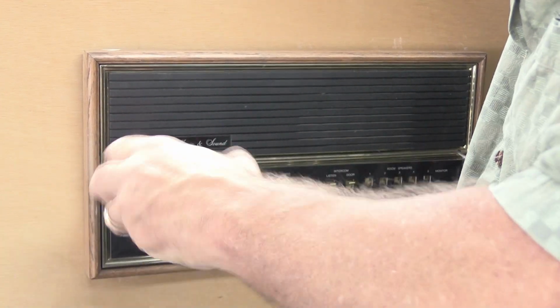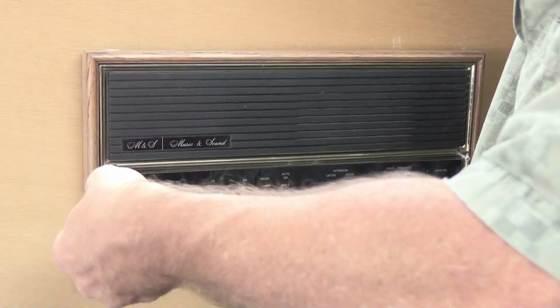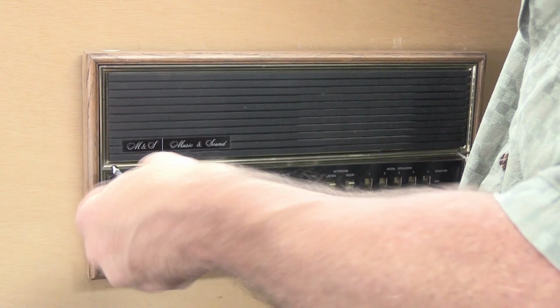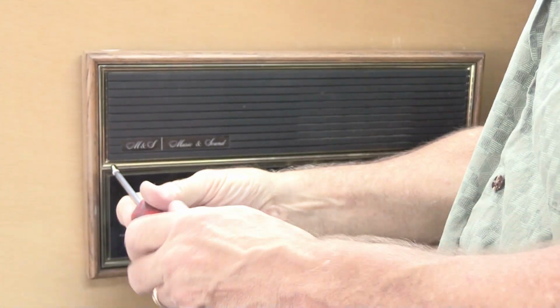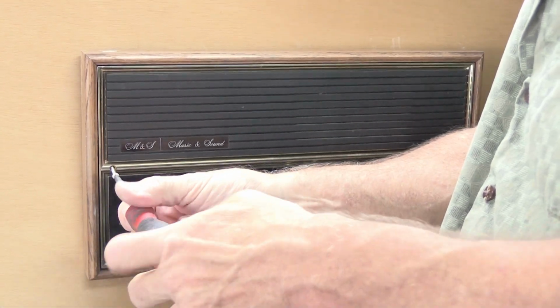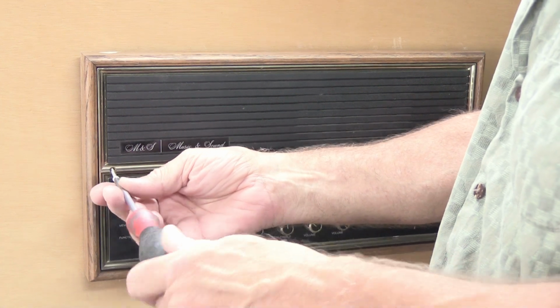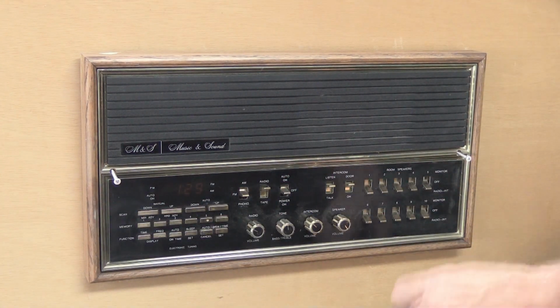Of course, this is easier to do if you're not standing off to the side, so you don't block the camera. Now, you might be tempted to use a cordless screwdriver. The risk you run when you do that is if your screwdriver tip in the cordless screwdriver or drill slips, you could round out the Phillips head, and then you're going to have a hard time getting the screw out. So that's your risk. So I've got them out now.